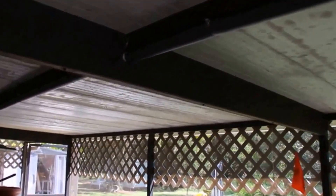I've got a temperature gauge and a shutoff valve. This is my insulated CPVC running up the wall and across my screened lanai — it's an aluminum roof so it gets very hot. I've got CPVC inside of a PVC pipe; this is three-quarter inch, and that's because I drilled the hole through the metal and wanted to make sure it doesn't rub and cause issues.